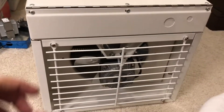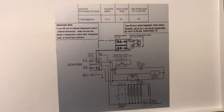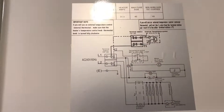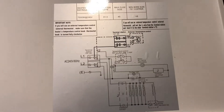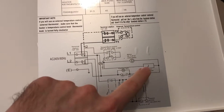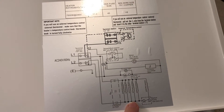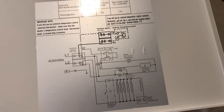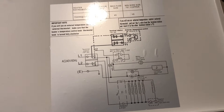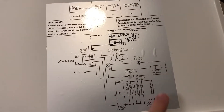The one I have is upside down right now because I'm working on it. This is the 7500-watt model — they sell these in a couple different wattages and that's the bigger one. Here is the standard wiring diagram. This is where your power comes in, then there's your temperature control thermostat, your contactor, fan motor, and the heating elements. It looks like there are five elements, and there's a switch to run up to 7500 watts or 6250 watts if you don't have 40-amp service.